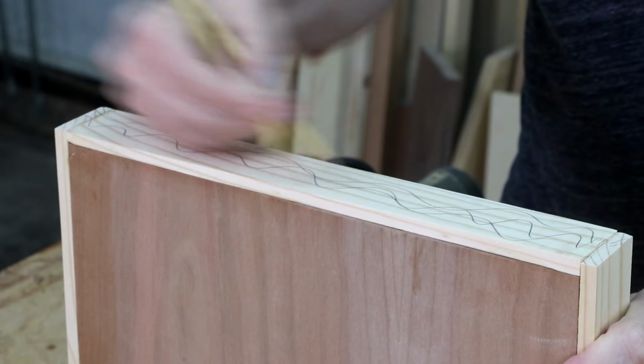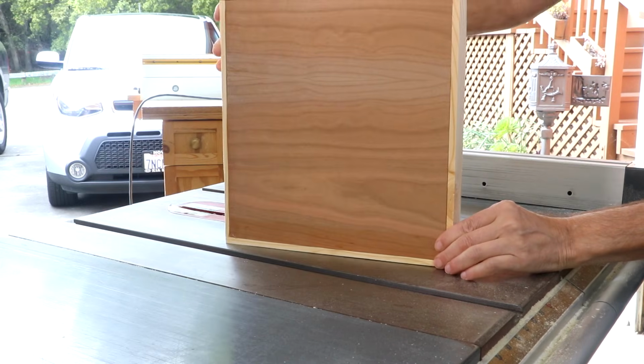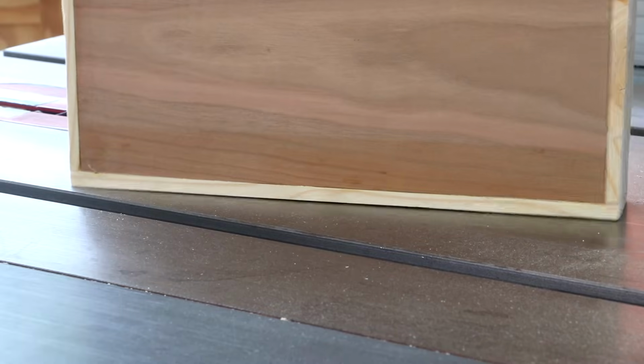There's nothing wrong with sanding uneven joints. Just make sure you sand equally along the length of the board. Making a pencil mark along the entire board can help. Sand until it disappears evenly. By the way, whenever you want to test if something is flat, use your table saw. Its table is probably the flattest surface in your shop.